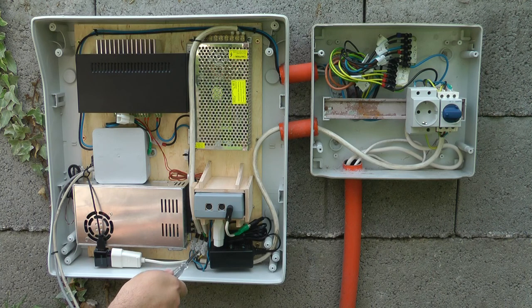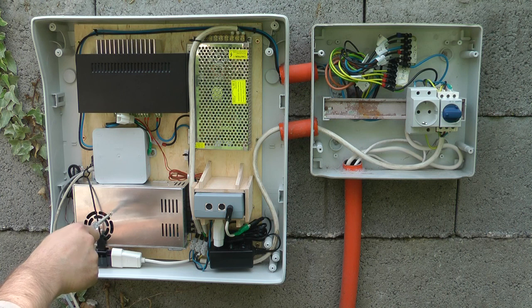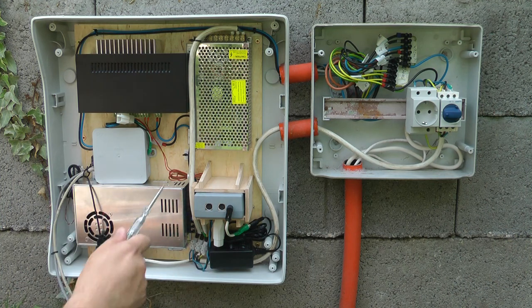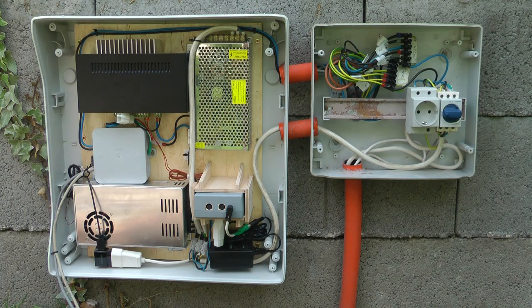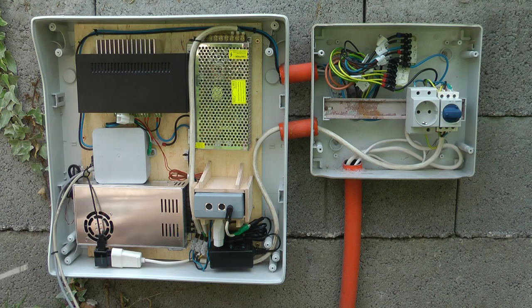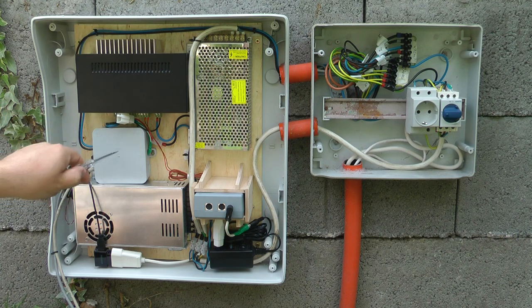From the switch I have the main power coming through here, I have another terminal block which gives power to this transformer for the booster - that's 24 volts, 13 amps, with the voltage toned down to about 20 volts for the Märklin. And this is an auxiliary 12 volt power supply for anything I'd do in the future like lights - it's a bit overpowered but it's something I had lying around. The power goes from the transformer to this booster.